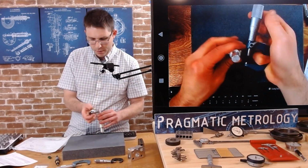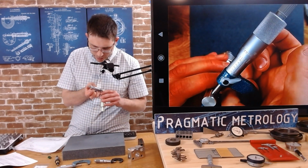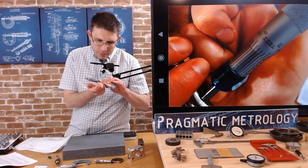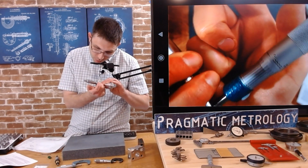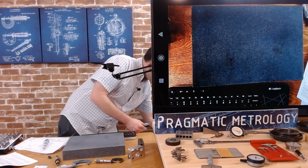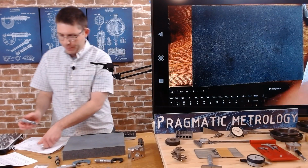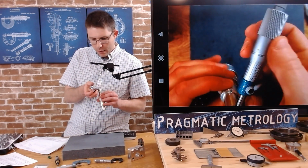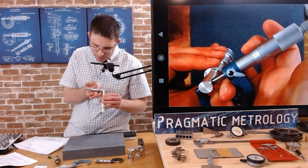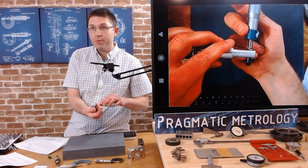Get another reading. I'm going to do it at pretty much the same level. And what are we at now? We're at a different reading. We're at about 0.516, and let's call it 3/10. I think 4/10 looks better. So 0.5164. I'm going to write that down off camera. Okay, and we'll go around and do another one. We're just going to quickly read these so that we can move on. 0.516. Let's call it 8. And then I'm going to move down. I was doing all of my measurements on right about this level.